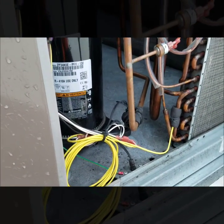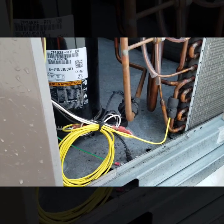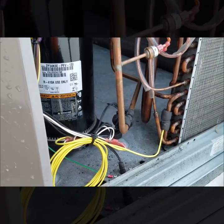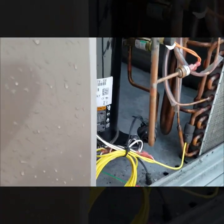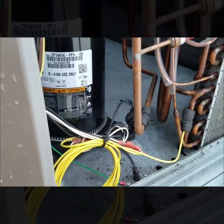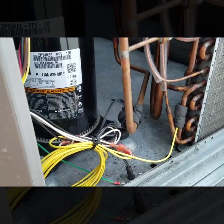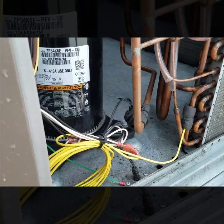You can also log in using what I think is called the gateway — you can plug it into the board and log in from your phone to look through it and do a lot of programming. Tech support was also telling us that I'm in a really wet climate — it rains like nine months out of the year — and when moisture gets into these connections it'll actually mess with the sensors. You might come out and test them one day and they read bad, then come back on a sunny dry day and everything looks normal.